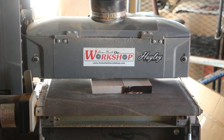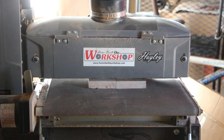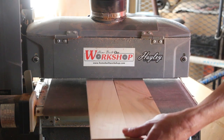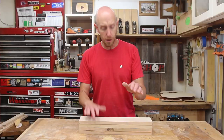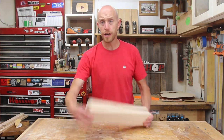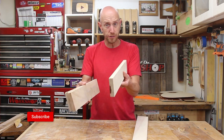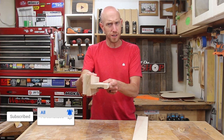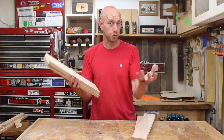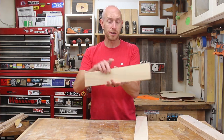With the pieces cut to size I'm now going to run them quickly through my drum sander just to remove the band saw marks. Right now I've got a nice little stack of three quarter inch wide boards cut at two different widths. The wider ones wind up being the base. These narrower pieces are going to attach kind of in a T. The base will become kind of the bracket that is going to allow us to connect this to the wall, or to the ceiling, or whatever. Right now we're going to focus on the narrower piece.